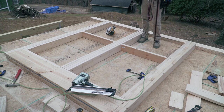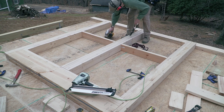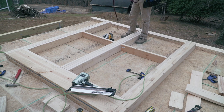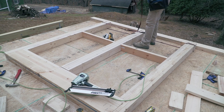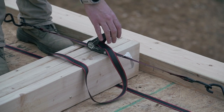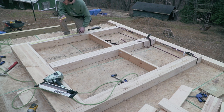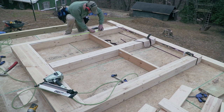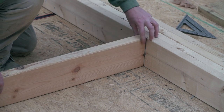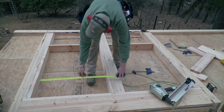I took my measurement and for whatever reason — I guess just because I don't know what I'm doing — the studs on each side are kind of sticking out, meaning we have an extra inch at the bottom. I'm gonna try to use this strap to tie it a little more. The next step is to mark up where the window opening is going to be. That's going to depend on the size of your window; in my case it's a 52-inch rough opening. I need to have those guys set at 52 and make sure I have my 32 spacing respected.